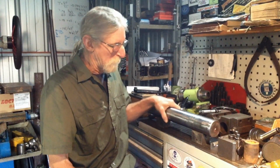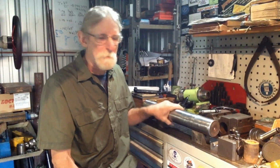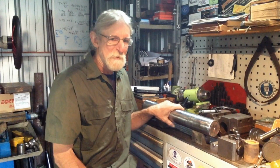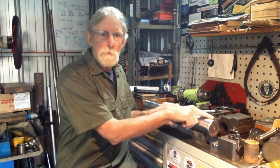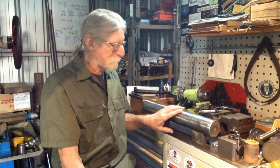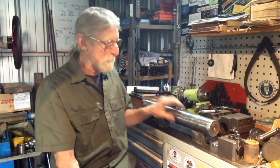Now a normal repair in the field and in a lot of workshops, what some people do when they come across this situation is they get straight onto the grinder and they grind the absolute crap out of the end of the shafts till it goes in the hole. By then they've ground completely a whole heap of material off the wrong side normally, and have totally stuffed the pin. So this way we just surgically remove the high spots and the pin stays in good condition.